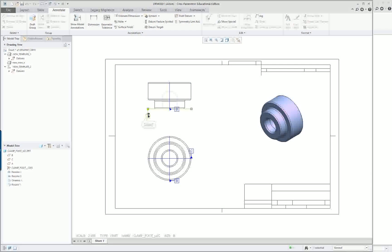I'm going to click on the annotate tab and start by moving things around a little bit. I don't have to have the datums in both views — I could erase one. We'll leave B here. Now it is a little flaky; I've been doing this since Pro/ENGINEER 13 and these new footed symbols act a little funny sometimes — you have to pick on them a couple of times. For instance I'm going to move this one and it flopped over there. We don't ask why, we just move it back to where we want it.